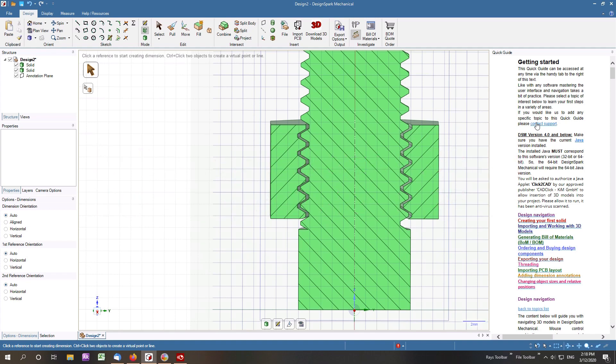It's just a matter of adjusting the plus 0.25 or the minus 0.35 between the bolt and the nut, and by doing that you can adjust that tolerance — 0.6 was the Ender 3. All you need is a thread chart with the tap drill diameter as your basis, and the thread pitch for that particular bolt. Once you've made the cutter, you can then cut your threads to suit.